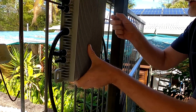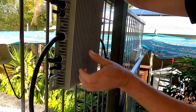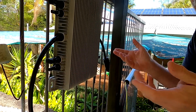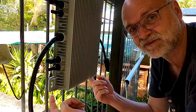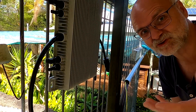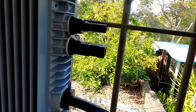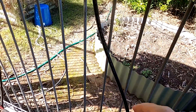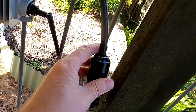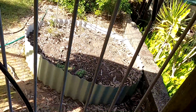It needs to be further this way, otherwise I can't access the MC4 connectors anymore. Okay, that seems to work fine. I'll put some sticky rubber underneath so it doesn't bang on the fence if it's windy. I'll close the loop of this wire so it can't be lifted up, and bend the front one against the fence. I've got enough access here and there — this is our outgoing power cable, extension for another inverter, and the conduit coming this way.